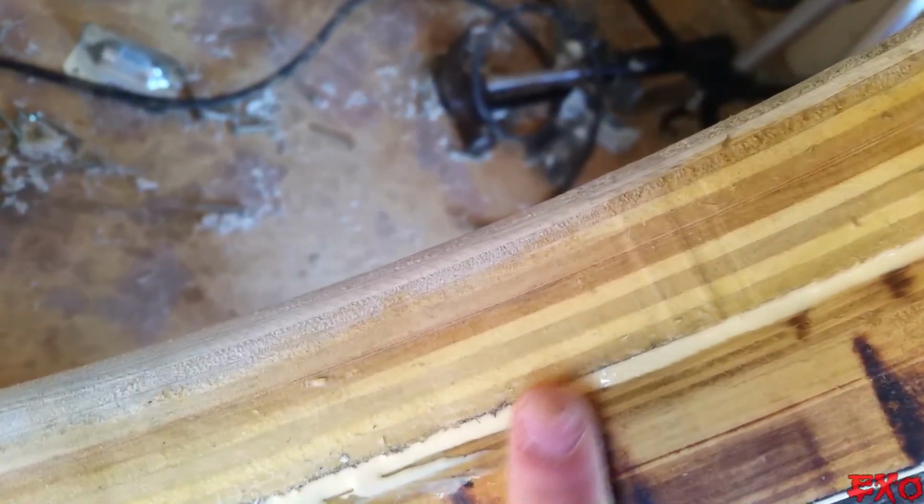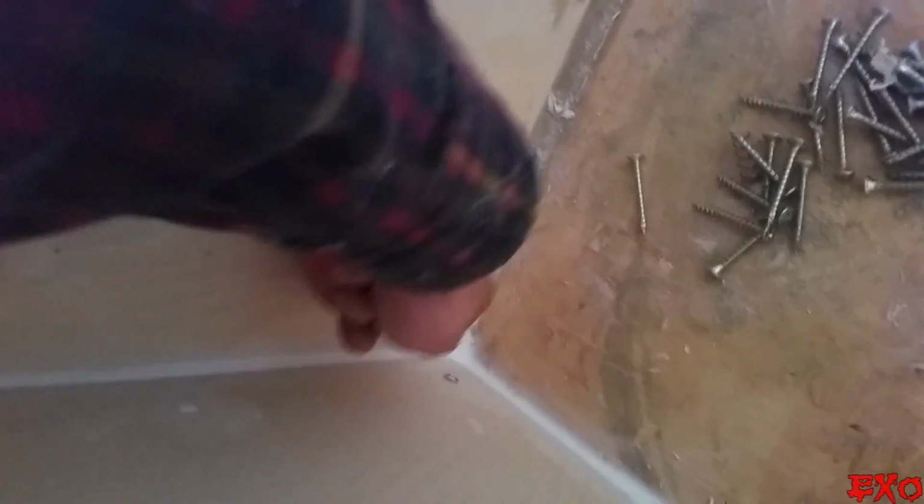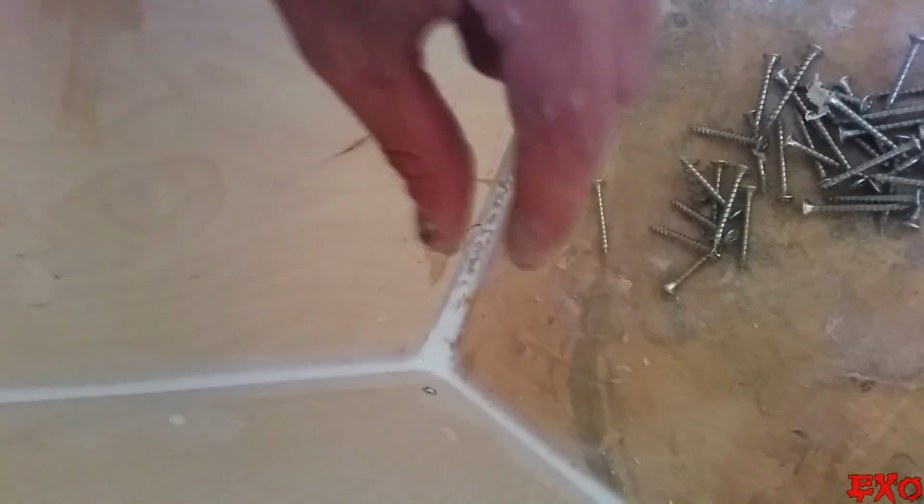So we're just gonna add the tiniest little bit of fill to make this perfectly flush, and you won't even be able to notice that it was two different pieces. And I came back and did all the silicone. Just that simple. I just did a couple beads and ran my thumb. You can see the mark where I had my thumb. I just went right along. It was a really small little gap, so I just filled up the little bit to make it sealed.